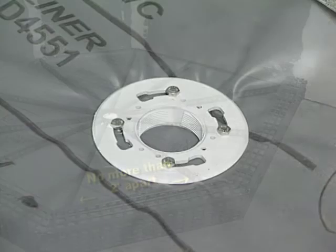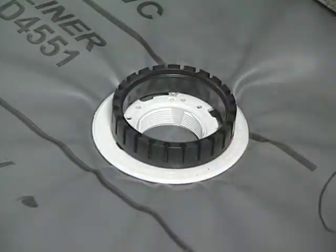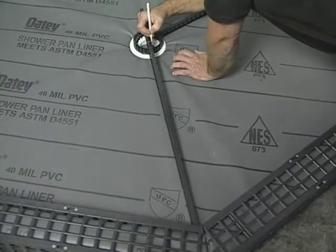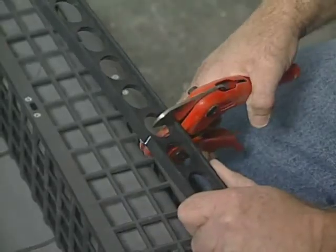screeding. Installation begins with the center ring centered over the drain hole on top of the flange bolts. The ring rests on the bolts to create the minimum 1.5-inch thick mud bed. Reverse mark the sticks that need to be cut and trim with your tool of choice.